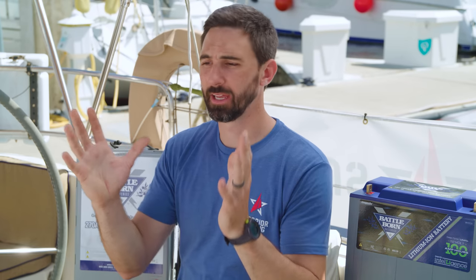A super common question we get is: can you start an engine from Battle Born batteries? The answer is you shouldn't. You can sometimes in a pinch, but you have to have a large enough house bank to do that, and it is not recommended. It is best to use a lead acid battery to start the engines. In that role, a lead acid battery is really good — it can provide a large inrush current and is very quickly recharged, and a quality lead acid battery will last many, many years happily starting engines. But when you're looking at a house bank, that is where Battle Born batteries thrive, because lead acid batteries really struggle with longevity when they're not fully recharged. A lithium iron phosphate battery works in that application very well, while a lead acid battery will die very quickly in a house bank when not often recharged.